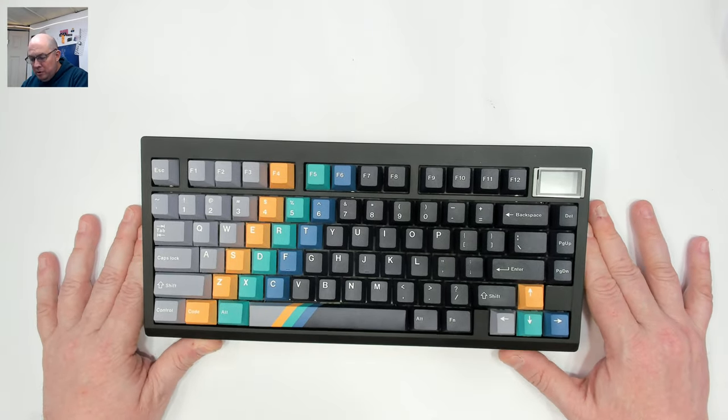Oh, looks like we got another one. Yep, we got a bent pin. All right. So no matter how many times I've done this, it still happens to me. But it used to be like, I swear, probably half of the pins would be bent. But now I've gotten to where it's only a couple. And I mean, I've built quite a few keyboards, so don't feel bad if it happens to you, whether it's your first time or your 12th time. These can be a little bit tricky. We're dealing with some really weak little pins, and they have to get just in the right spot. So I like to come in from the back a little bit, but then I want to make sure that center post is in, and then, awesome.